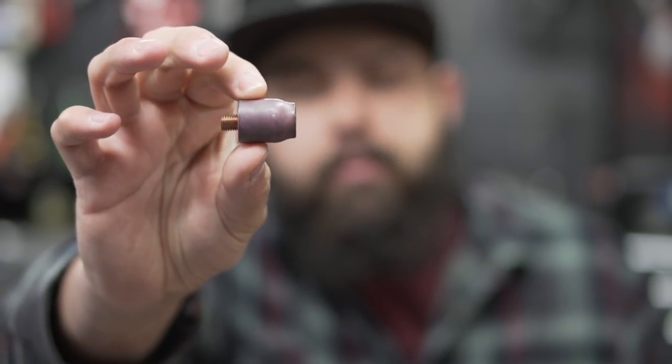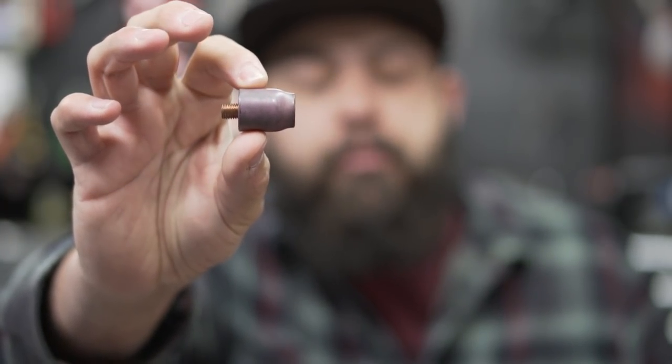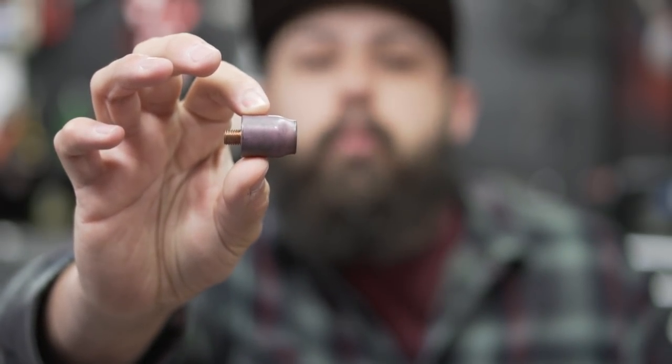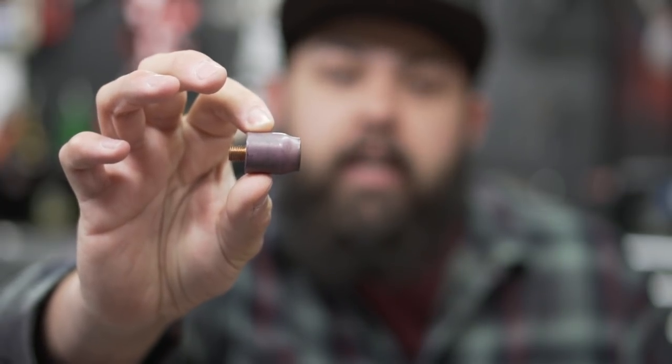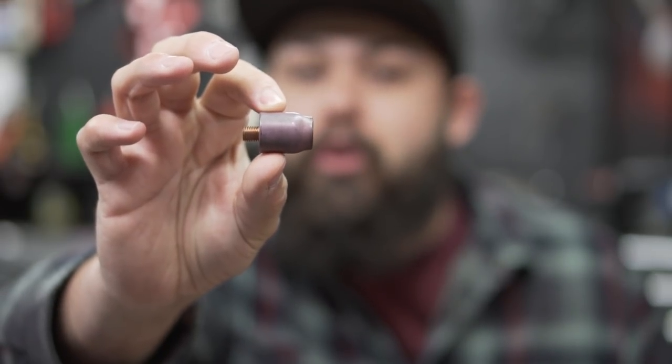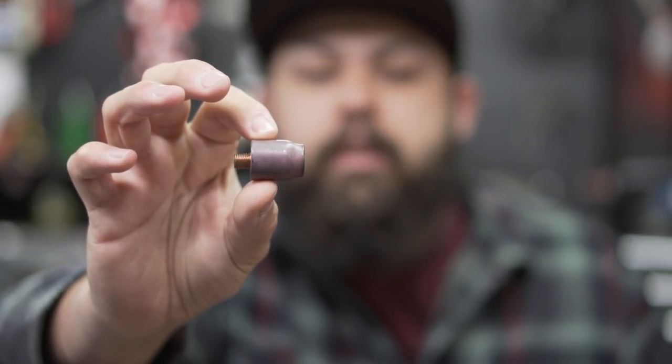Now this is a number 8 gas lens. You can go from number 4 to number 8, 9, 10 depending on what torch you have. I like to run a number 20 water-cooled torch, whether it's a flex head or flex lock from CK — that's my go-to because I like having a small torch in my hand, it's a lot easier to control than a 17 or a 26. Now the gas lens has screens stacked inside of the body to help aid in evenly distributing the gas flow. If you match that with a cup design, it basically takes all of the turbulence out of the path of gas flow, and there's a drastic increase in coverage compared to your standard cup and standard collet body.